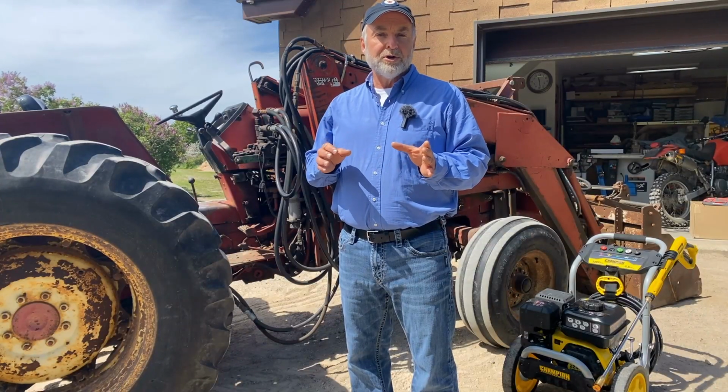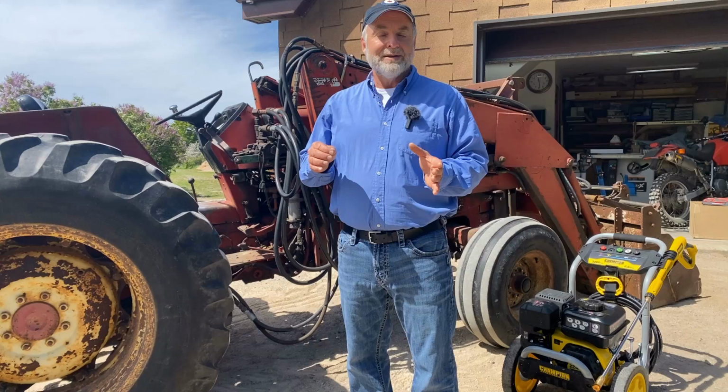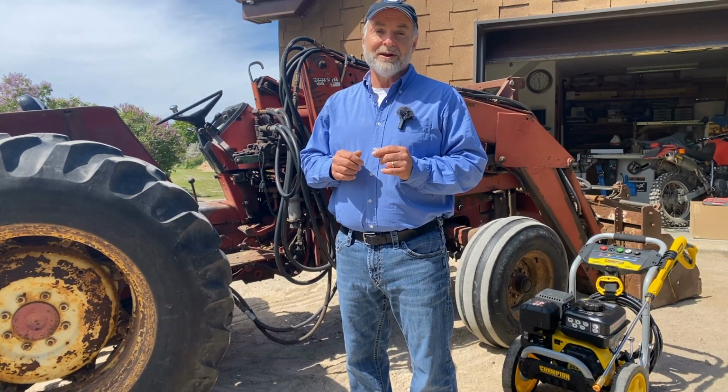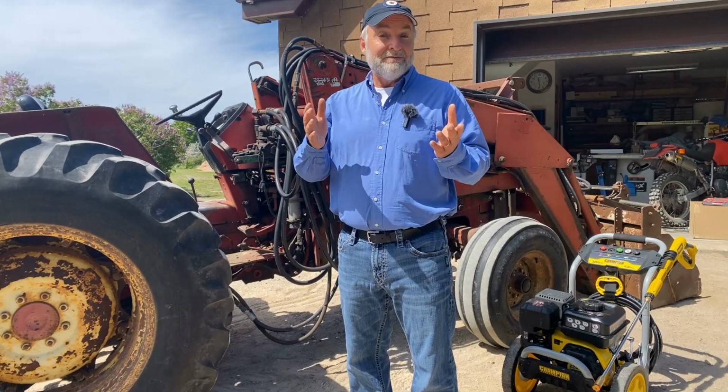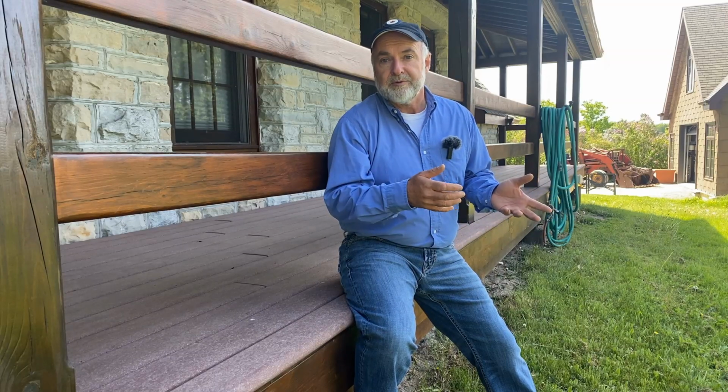With your pressure washer purged of air and an appropriate nozzle installed on the end of the wand, it's time to fire up the engine. And this procedure is different than starting a lawnmower or snowblower, even though the engines involved are similar. The challenge when starting a pressure washer is that the engine is usually under considerable resistance before it even starts. And since the water pump can't be disconnected from the motor, it makes the motor harder to spin over during startup. And this resistance to spinning can prevent the engine from starting easily.